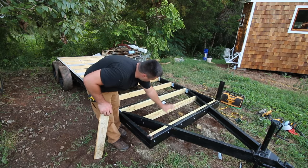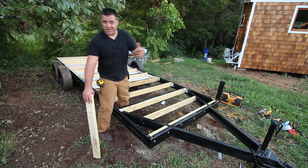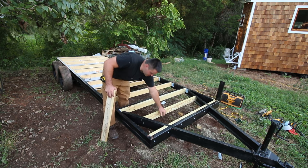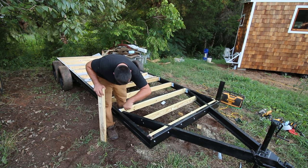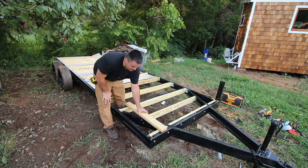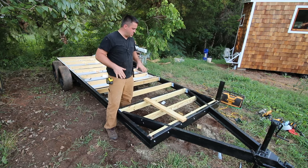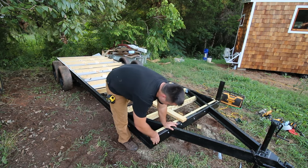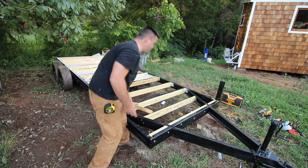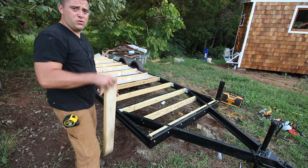I'm also going to sister up another 2x4 and put another 2x4 in right here — cut it on an angle so it'll sit flush. I'm kind of bummed because that video is already up, and I'm not taking it down because exporting takes forever, so I'm going to get trolled a little. I'm just tightening that down enough so that the carriage bolt is recessed in just a little bit. That tape job isn't the most beautiful in the world, but it will work.